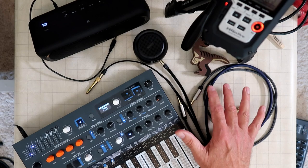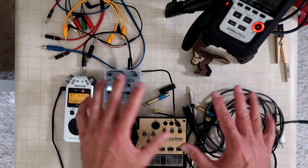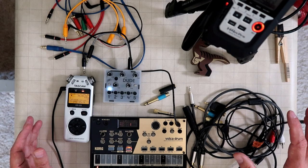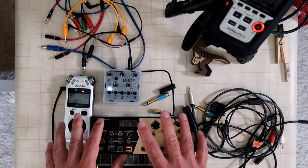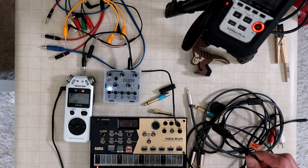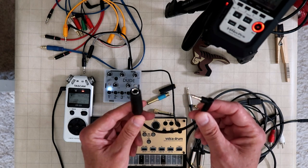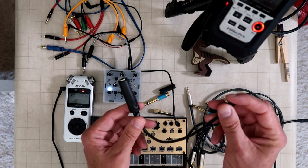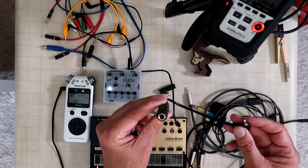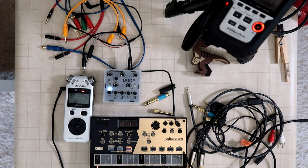Now let's move on to stereo — this is really the real deal about audio cables and connectors. I'm going to show a few things and then do a little demo. Pretty much any cable you can think of you can probably buy online. This is a TRS 3.5 millimeter male and a quarter inch TRS female — that came with a modular synth or something like that. Here are some barrel connectors — TRS female on both sides. And this is a favorite thing: a 3.5 millimeter stereo male to female with an attenuator in between — like a little headphone volume control — which I use all the time to attenuate the volume of synthesizers. It's super handy and not expensive.